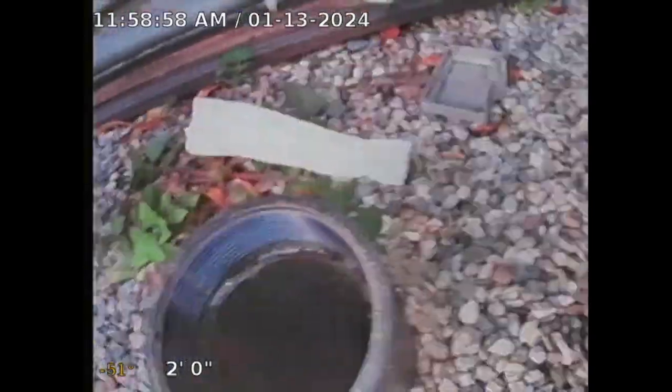I'm at a clean out located at the rear of the property — a 3-inch ABS clean out. Here's the property and I'll be sticking this camera in to see what we see in this main sewer line. I have the bathroom water turned on, and I'm going to try to get as far as I can and then come back dry.